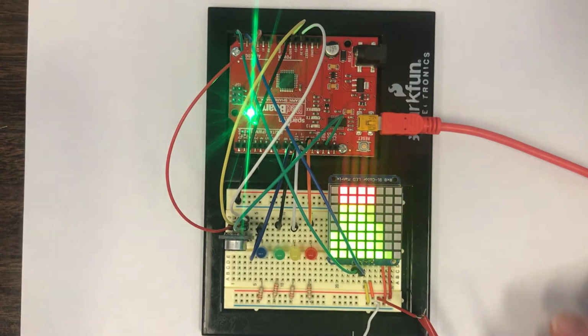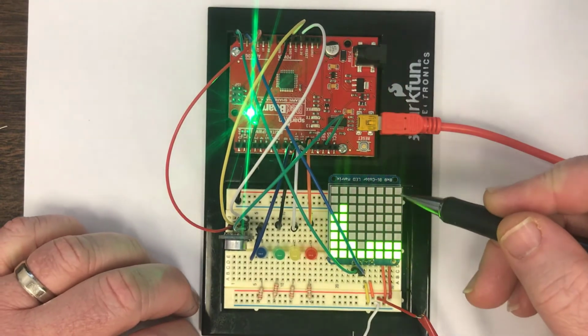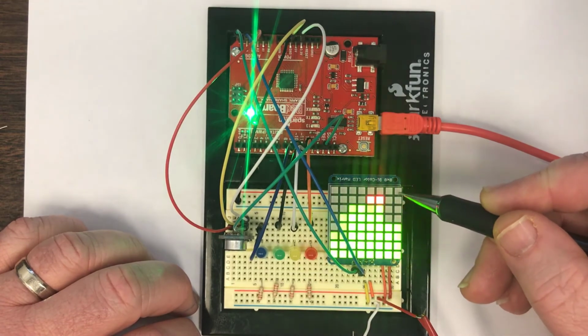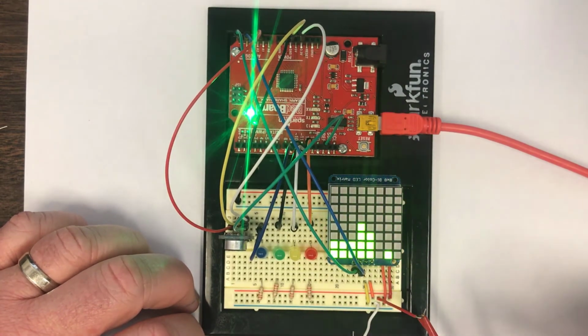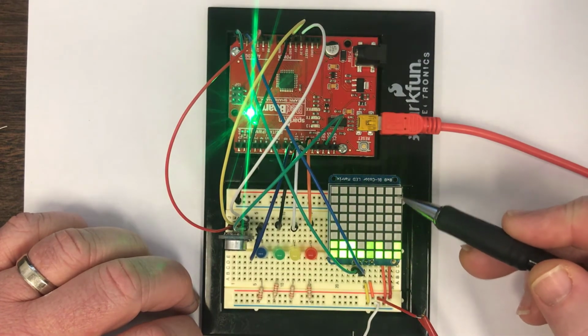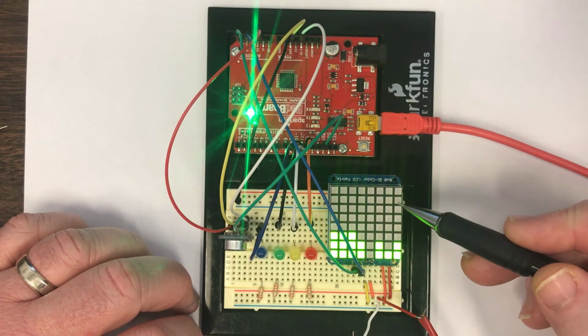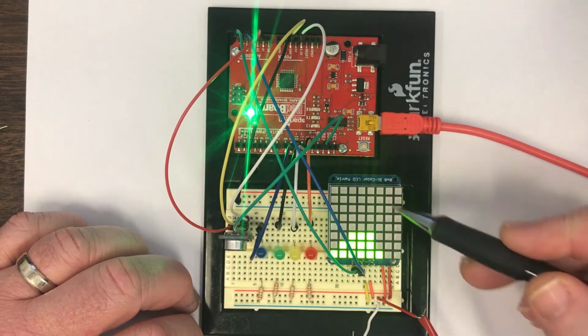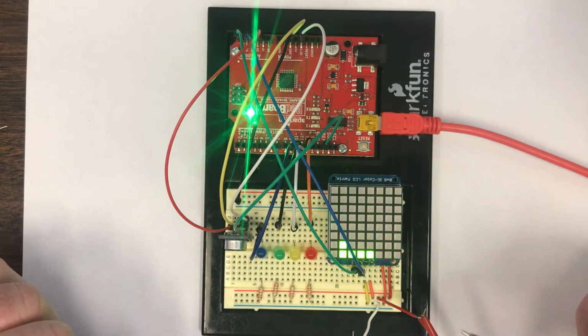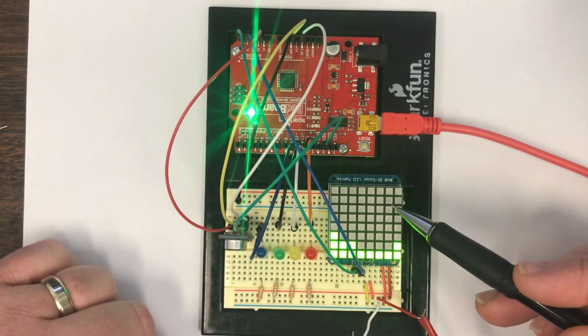And the top 2 bars are in the code. They're not hardwired. They're written so that if either of the top 2 bars has to light up, they're going to light up red. And that's sort of tradition that when audio engineers would see something like this, they would say, oh, I've got the gain set too high. I need to lower the amount of amplification so that I stay down here in the green. Because if I go up into the red, it's possible that I'm going to saturate some sort of a transmitter or another amplifier later on.